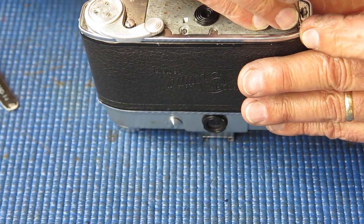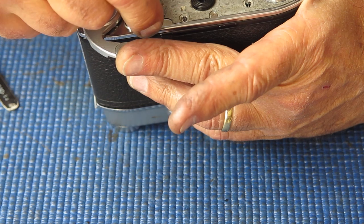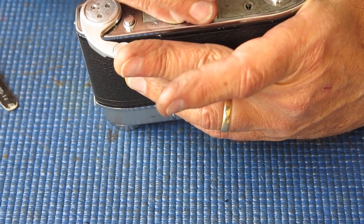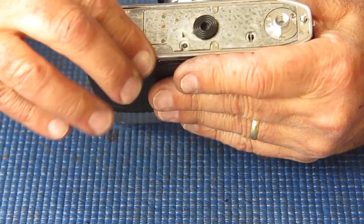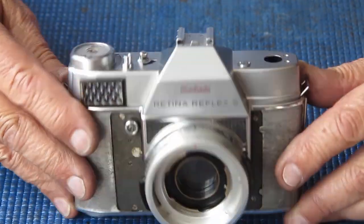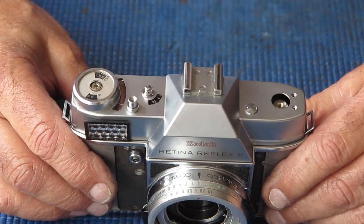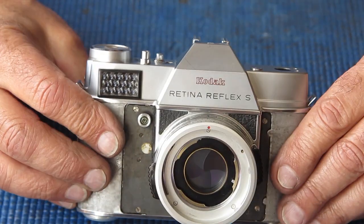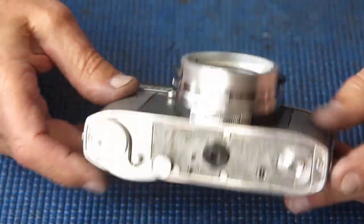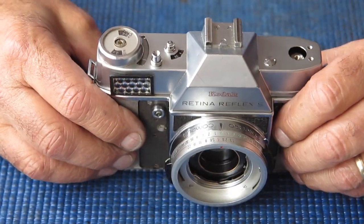And that was just 3/4 of an hour I didn't really need to lose. If I'd been a little bit more cautious, it wouldn't have been a problem. Though I have to say that was a very unusual problem. It doesn't normally happen that the film advance can back up far enough for the cocking rack to actually disengage. There we go. That part we're all happy and done. My next task with this camera is not the leatherettes. My next task here is to clean and then fit the prism.